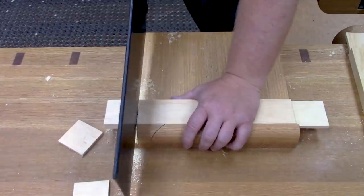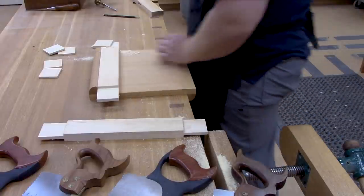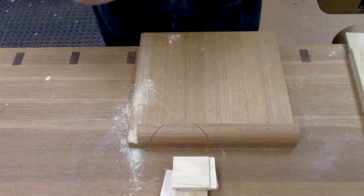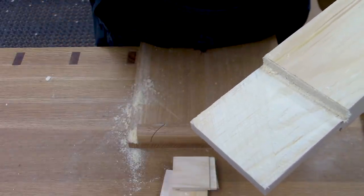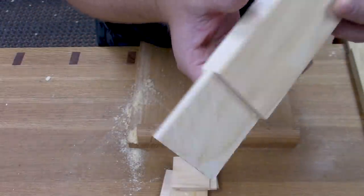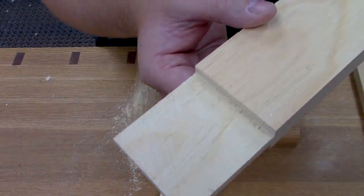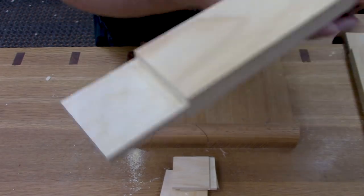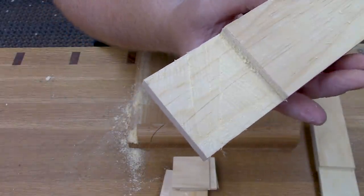The first thing I notice is just getting it started — it really blows the grain out. It does cut fast but you're kind of holding on for dear life. So we have these cut. If you look closely at the face grain, you can see the angled cut from earlier; turn it around and you can see the finish of the angle cut — kind of a crisscross. The set of your teeth, how aggressive the saw is, and how well you're sawing is going to dictate what your finished face grain looks like.